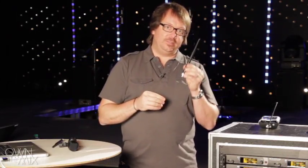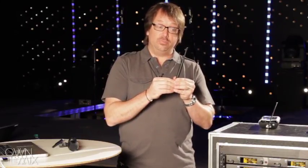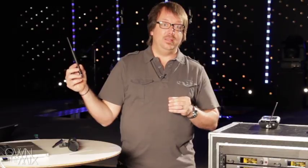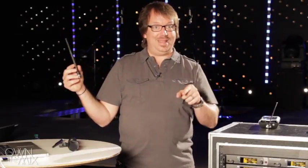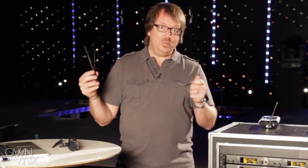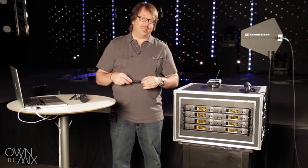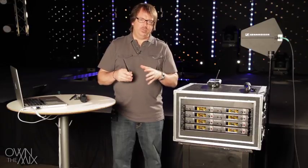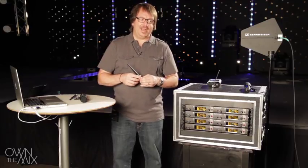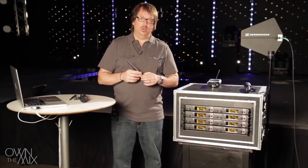If this antenna is in one location and a dropout would occur due to phase cancellation from reflections around the room, if the antenna were over in a different location it's unlikely we would have a dropout at exactly the same time. So by using two antennas with a little bit of space between them, we have a better chance of getting clear reception. That's the basic idea behind diversity reception. There are a few variations with names like true diversity and antenna diversity, but the idea is multiple receive locations for antennas to minimize the likelihood of a dropout.